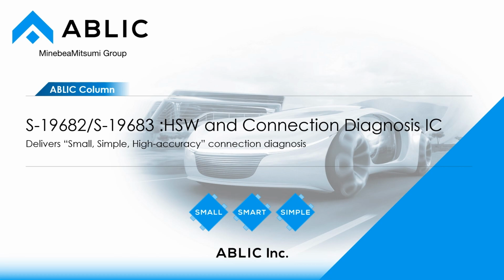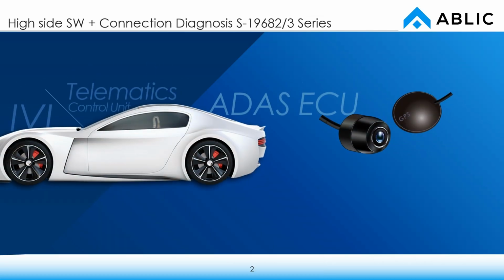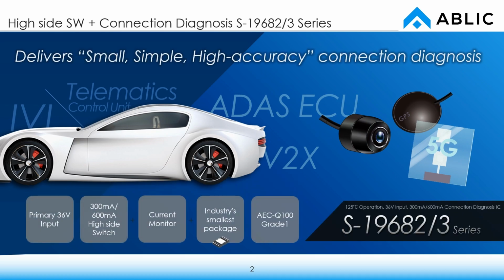Today I will talk about S19682 and S19683, high side switch and connection diagnosis IC. S19682 and S19683 series are a one-channel high-side switch with 36-volt input, 300 mA and 600 mA output current monitoring function, and it is available in the industry's smallest package HSNT8 2030.